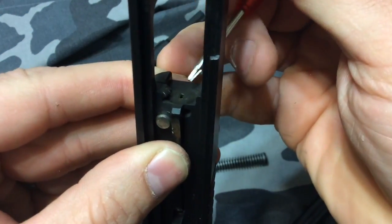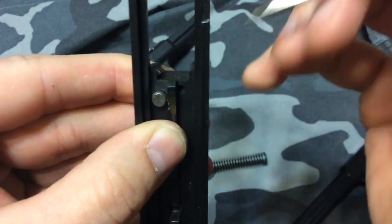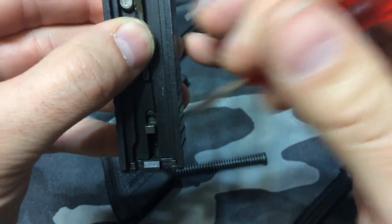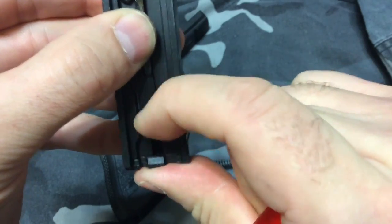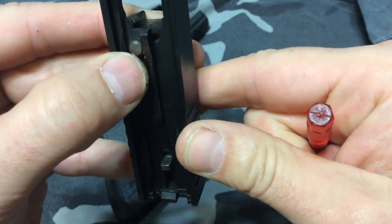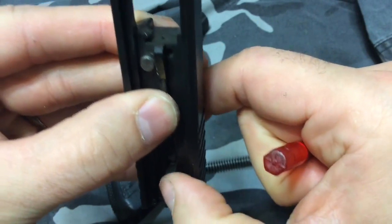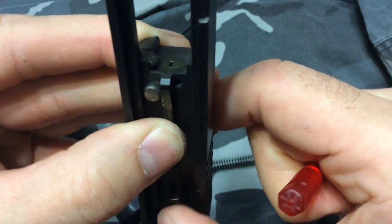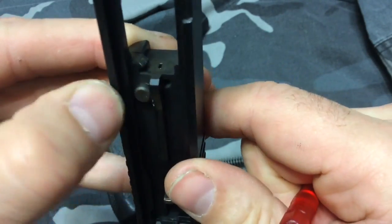One final view. This is the breech face where the back of the cartridge sits. That is the firing pin safety and that is the back of the striker — spring-loaded. If you try to push forward on that firing pin, on that striker, it stops before the breech face because of the firing pin safety.